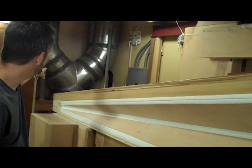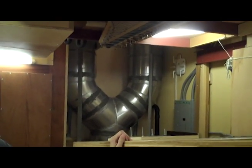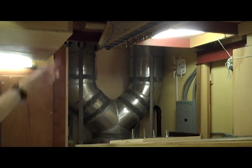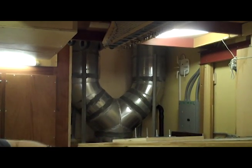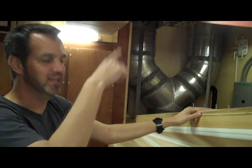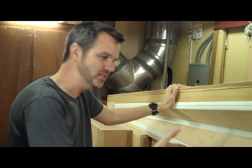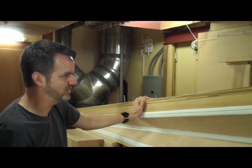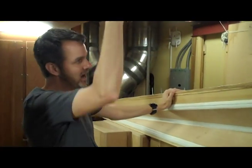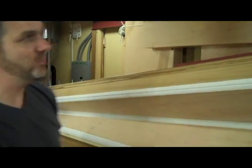There's a little bit of electronic equipment here. You can see the back of the stop knobs on both sides — they have electromagnets that allow them to move in and out, hooked to the organ only through wiring, no mechanical connection. The combination action memory is just a series of computer cards, a fairly compact action that remembers all the stops in the whole organ. There's also a total recall system — you can save things on a flash drive, allowing lots and lots of combinations. Those gigantic silver ducts are the destratification system — they're not part of the organ. They circulate air through and around the organ because the temperature difference from bottom to top can be 10 degrees or more. Since temperature is the primary thing affecting tuning — pipes go sharp when warm and flat when cold — this system minimizes that effect.